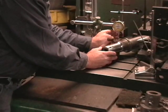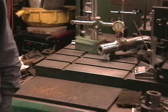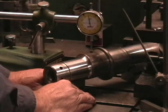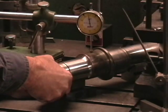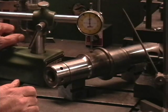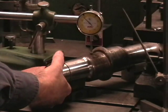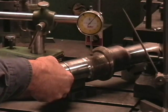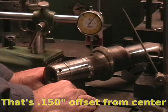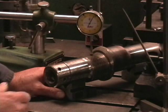I'll put that under center. I'll find the center in the V-block — or the center on the lobe; you really don't know yet. I'll rotate to make sure I'm there, set my height standard to zero, and rotate it to see how much displacement it has. There's 100, 200. These are supposed to be 150 and it looks like it's more like 145 — about 147. So I'm going to split the difference.